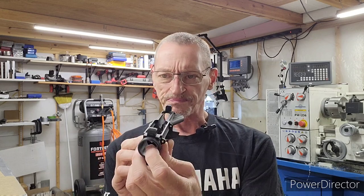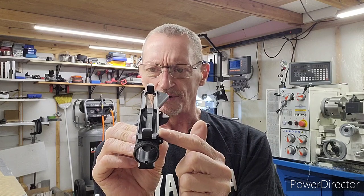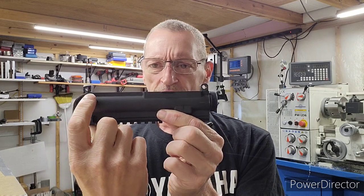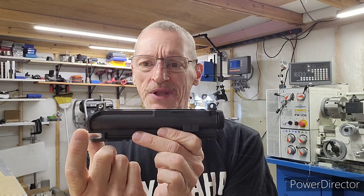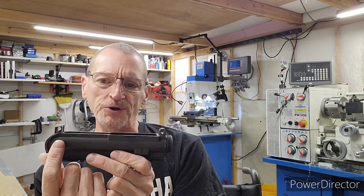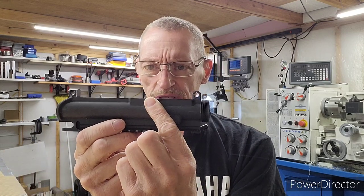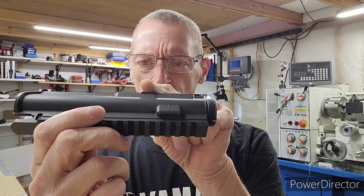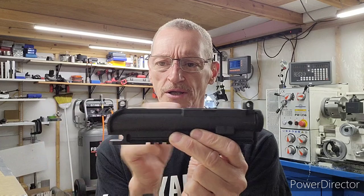So we're just going to go with this. Here on Part 13 today, we're going to make this quick — I know it's Father's Day and a lot of fathers are out there doing their thing. We're just going to go ahead and finish this profile today. We already cut to almost 200 depth — I actually cut it to 190, I was 10 off my finish and never dropped it to 200. It's sitting at around 188.8. What I decided to do is drop down to 250 and do a 250 depth all the way around that profile. That's all we're doing today — finish the bottom profile.